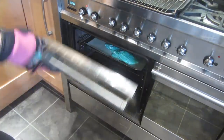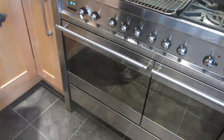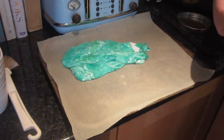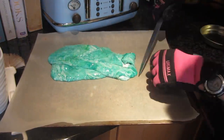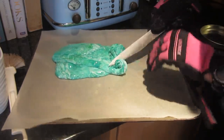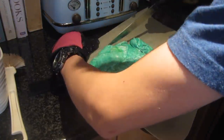After about 30 minutes my first batch of HDPE has completely melted down. Since the HDPE is very sticky and it's above the boiling point of water I'm going to be wearing some gloves to protect my hands from the heat. Just to make the HDPE easier to work with I'm going to scrape it closer into the middle using just a normal chef's knife. Once that's done I'm going to start to apply a layer of blue lids.